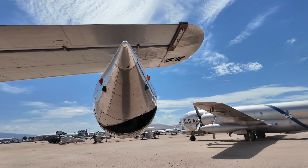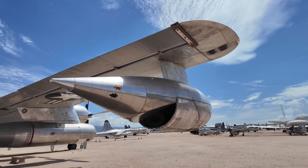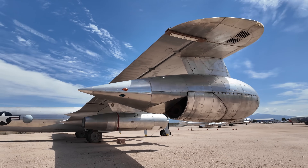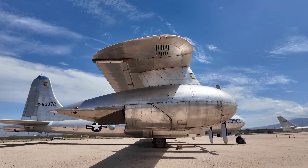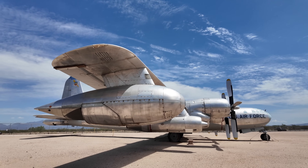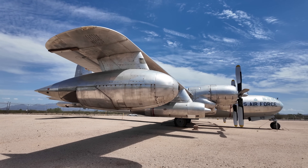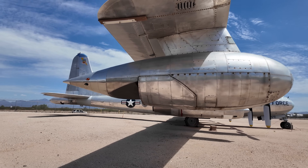Additional large fuel tanks were stored inside the bomb bay, while the regular B-50 could have auxiliary fuel tanks underneath the wings. Another upgrade from the B-29 was a reinforced wing, required due to the larger engines and props, the increased fuel load, and the landing gear. They used a new type of aluminium known as 75S which was stronger and lighter, so the new wing actually weighed 600 pounds less. They also installed larger flaps to help take off with the extra weight.